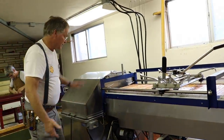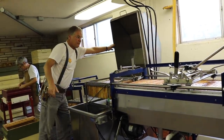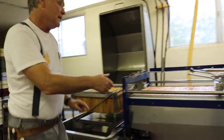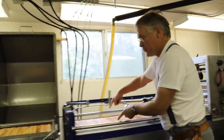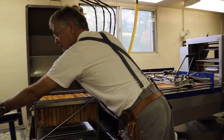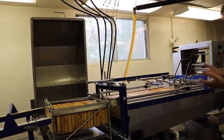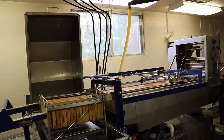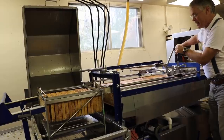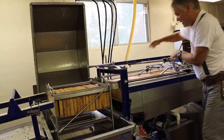We're now ready to advance these frames into the extractor. To do that we open up the lid of the extractor, reorient the rack so that it's vertical, and then connect this rail with the rail in the extractor. We connect the outfeed rail by pulling it over. Now we have one continuous rail running through the system. I get my sticky hands in some water to get them freed up so nothing gets too sticky. We select that spot right there — there's a little mark that indicates how many frames we're going to be pushing through.